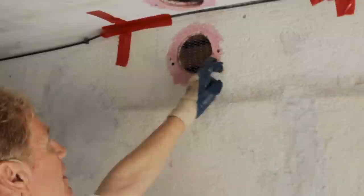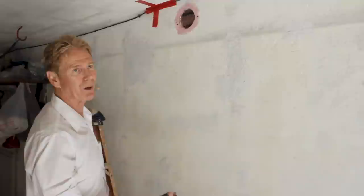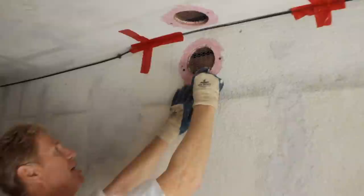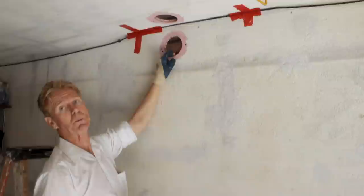Is that all we do? No. Now we put a bonding agent around the perimeter. We don't need to be as thorough as we are, but we're thorough. We put a bonding agent around the perimeter — that's what this pink stuff is. It's a bonding agent. Then we cut a piece of wire and put that mesh in there. So now our Structolite — and Structolite is a plaster — it's going to mushroom through this wire mesh and through these holes. It could also just be solid backing — that's what they have here.